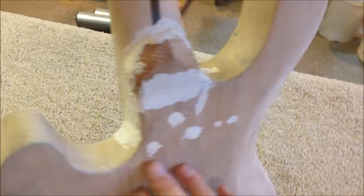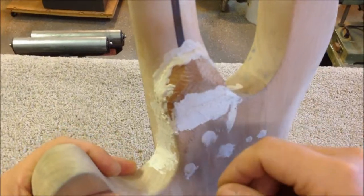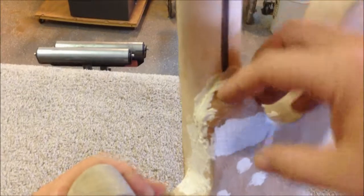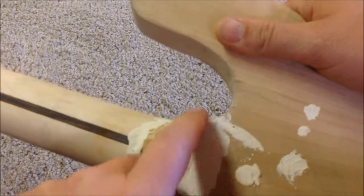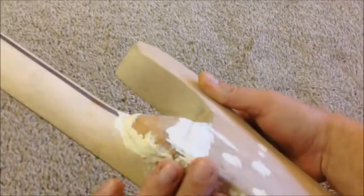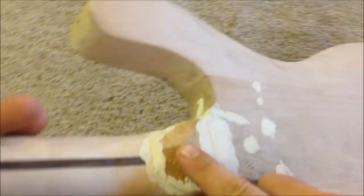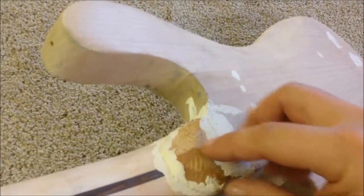I got a little excited and got ahead of myself. It's tough to remember to stop and video every step. I put that wedge of wood in and then got some wood filler, watered it down, and tried to see how far it would get down into the cracks. It did what I wanted — it split a little at that one seam, which is what I expected. It's going to serve as a nice little guide as I start shaping the last part. I'm going to sand it all down first before resuming with the heavy files and chisels.